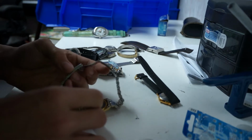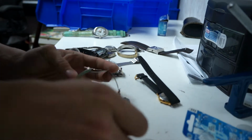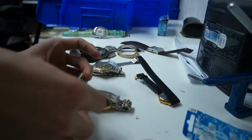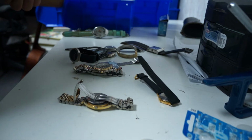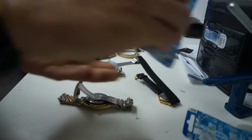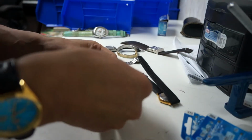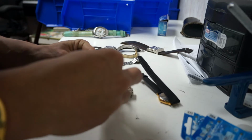And let's see, 364 type battery goes in there. Put the cap over there so you protect the little coil. Grab a 364 type battery. Oops, got one right here. Pop that out and put it in there. And I just need to get the back aligned and back on there. Should check if it's running first though.